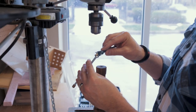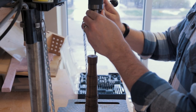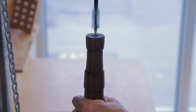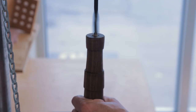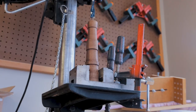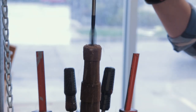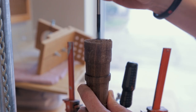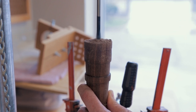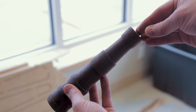I found a bit that closely matched the size of the bolt and set up the drill press to drill a hole through the cannon. I then went back and clamped the cannon down like a smart person would have done in the first place, and drilled the hole. I then flipped it over and drilled a smaller hole through the back just big enough for the threaded part of the bolt. I checked to make sure the bolt fit right into the cannon and it did.